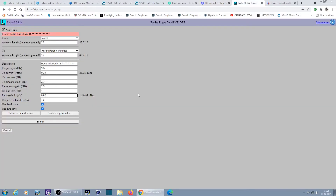Let's see in our simulation with one of these devices how far we can go. I'll set 2.8 dBi on my side too. I am 25 meters above the ground, about 50 meters above sea level. The antenna height on the other side I'll assume is 15 meters. I'm using frequency 902 MHz since this is the free version of Radio Mobile. Power is 27 dBm — leave it there.